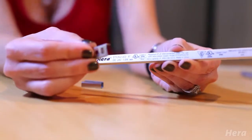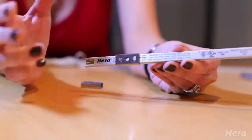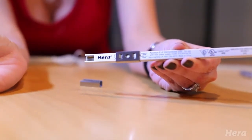Once you have all your mounting clips in place — whether by using screws, double-sided tape, or if you're using the 3 or 4 foot stick LEDs, using the magnetic mounting clips — all you need to do is snap it securely into place. Stick LEDs come in cool white, 4100 Kelvin, or warm white, 3200 Kelvin.